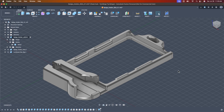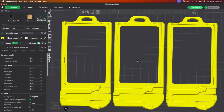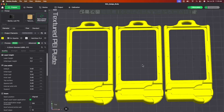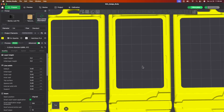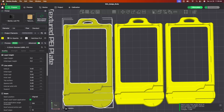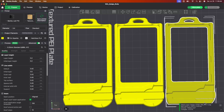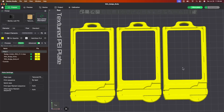Here's my quick 30,000-foot view on how these file types can impact you. Inside my slicer I have three of the same part — same CAD design, just exported differently. On the left is the STL, in the middle is the .3MF, and on the right is the STEP file. When you export STL or 3MF, your CAD software actually meshes them before they arrive — you need that mesh before you can 3D print. The three files are at first glance very similar.